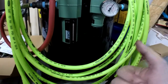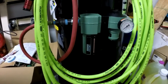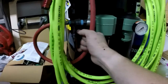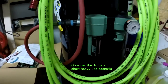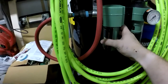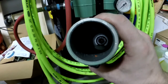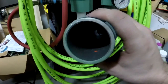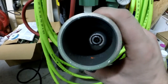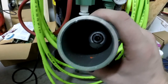To show you how much moisture one of these filter regulators can take out, I just let the air out. This is really cold because of the very high flow when the air was released. Let me pull this reservoir off so you can see the water for yourself. I barely use this and that right there is a decent amount of moisture that could have gotten into a tool — yeah, there you go. Even though this is a big bowl, that is a lot of moisture to be getting into your lines and tools.